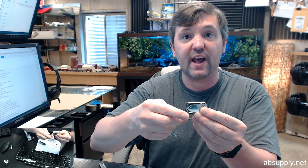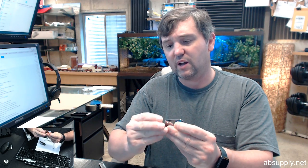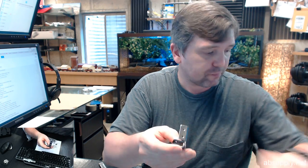So the last time I ordered these, I think I allowed a pre-fit of 11/16. I split that margin between the top and bottom and had some very thin rubber material that I used inside of here for top and bottom mount. The downside of that, of course, is you're not going to slide that glass into the opening when you've got the hinges attached, so you kind of need to get help when you're installing these, if you do it via my method, to get the glass hinges down over the glass itself and then to get it in place. You can get one of the hinges installed naturally, and there you go. Width, of course, kind of dimension, you know, you're going to have from the sidewall to where the U-channel starts.